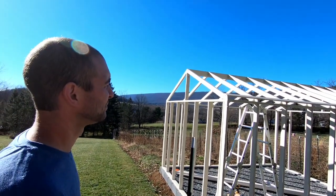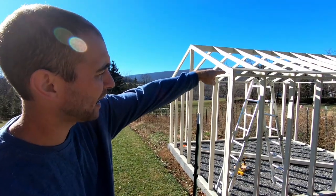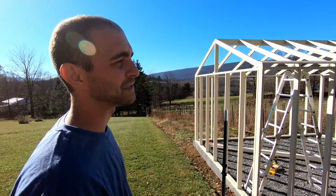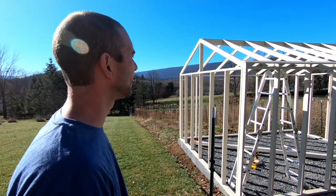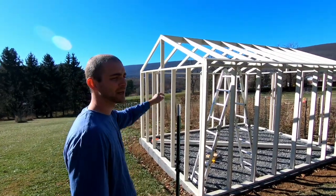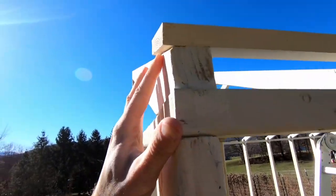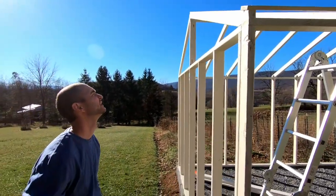You know, it's different. But either way, I'm gonna mark the middle of both ends of the rafters and the middle rafter. So I'm gonna have to figure out a way to make sure it's in the middle on the middle ridge beam. So that's gonna be tough. I might just mark where the outer edges have to be and stay within the lines. I'm not entirely sure yet, but we're gonna wing it and see what works. So first we need to get one of these slats up there and held on by the one that's already secure. Okay. These do end up being a little bit longer than I hoped for, slightly. So I'm gonna have to come back here with my flush saw to trim that off. Well, and the siding material probably won't fit on all that well if I don't.